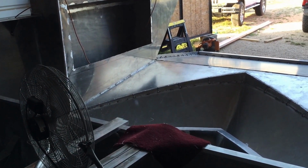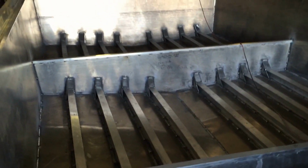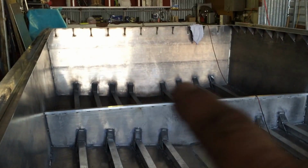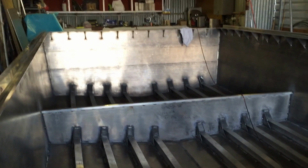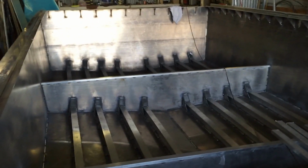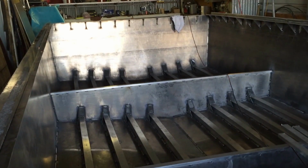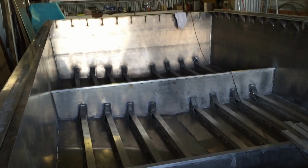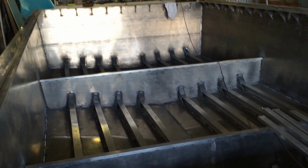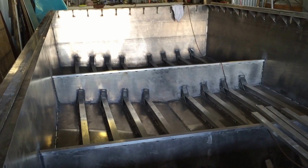So I got all, doing these I-beams and stuff, and created a lot of work for myself, because the bottom of the boat wasn't completely flat from just walking on it and this and that. It has a six inch rise from the center to the outside edge. So it was laying on the floor, and you're walking on that, so you're dipping it, and you're no longer flat, your sheets aren't flat, they're starting to get dipped. So that was probably the first mistake I made. The bottom of the boat should have been secured to a big jig. A little 20-foot boat, not near as important, but a 40-foot boat, that's a lot more length. And bottom line, save yourself some pain, and just make a jig, and then later on you can use it as your trailer.